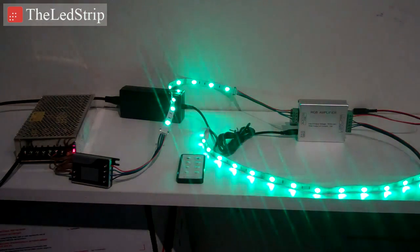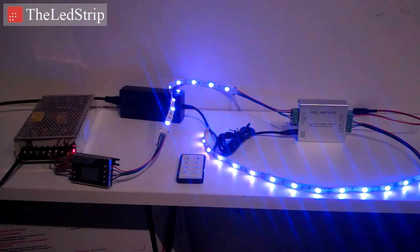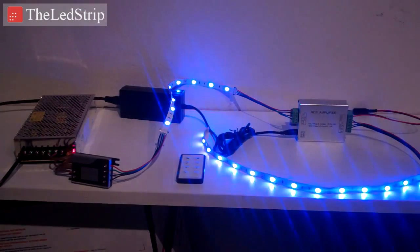On that same side of the amplifier, you're going to see a power in, a little coax connector, female on the RGB amplifier. So the male from the power supply can plug in on that side. And then there's also another input on the upper right side, as you look at it in the picture, where I've already screwed in a female connector.